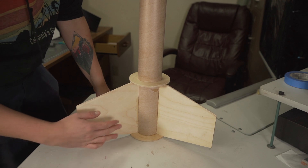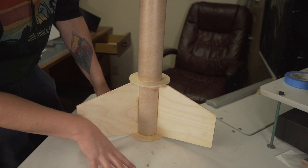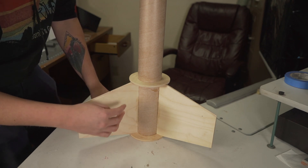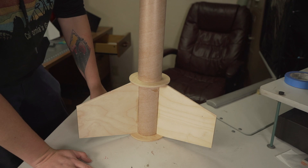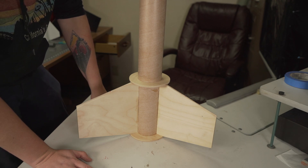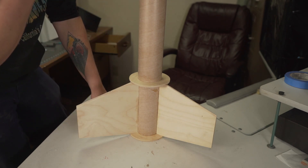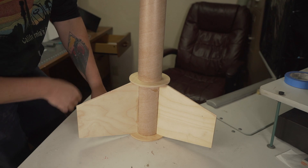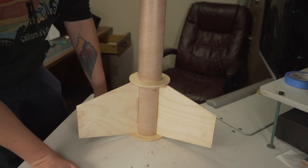I'm going to do tip-to-tip glass over the motor tube because I broke a fin off my 7.5-inch Lock Iris — all it did was take the fillet from both inside and out, the internal and external fillet, and just rip a little layer of cardboard off. My ideal solution from now on with cardboard rockets is to reinforce the joint to the motor tube with fiberglass. Some people might point out that I didn't peel the glassine layer on this, but the Iris's tube was peeled and it didn't make a difference — it just took another layer of cardboard off with it.